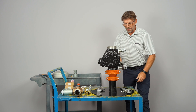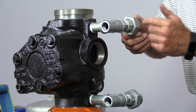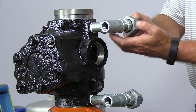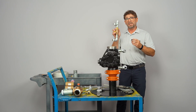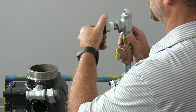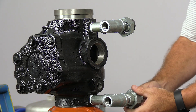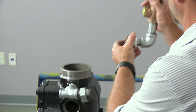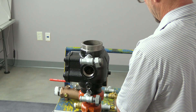One thing to note: these two components are going to be shipped with the unions assembled because they're a match set, so be mindful of that. The male and female halves of the union will have to be separated and added to our trim component. The top outlet should match up with your top union — go ahead and install that loosely and we'll come back to it. The bottom union gets separated; take the bottom half of the union and put it on the bottom port of the outlet for your alarm bypass trim. Just hand-tighten that for now and we'll come back to it.